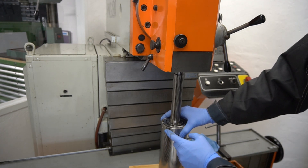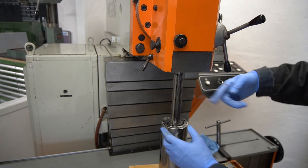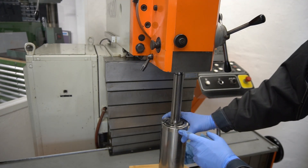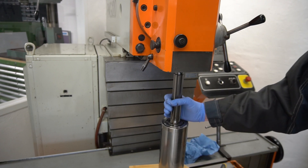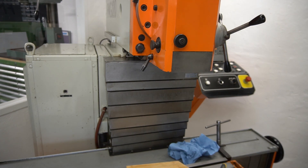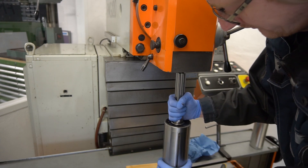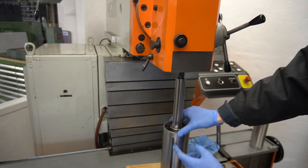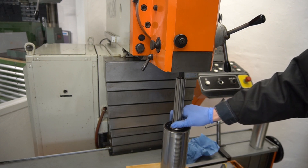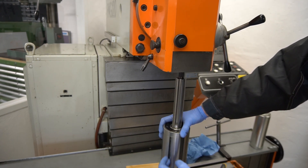As you can see, the rack is cut all the way through, so you don't need to worry about the gear mechanism. You can just lower it as far as it can and it will just disengage when it bottoms out. Here you can see the keyway or slot where this knob or key will need to align into, to prevent it from spinning — and also it's the mechanical stop of the travel.